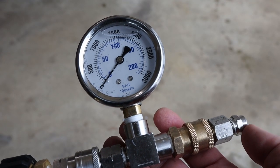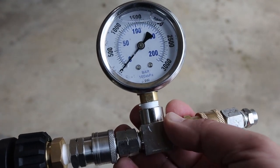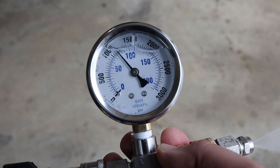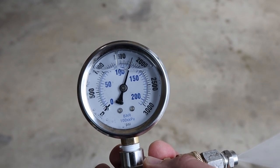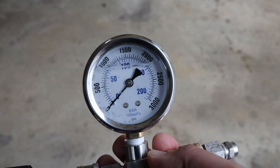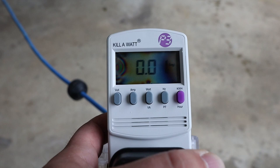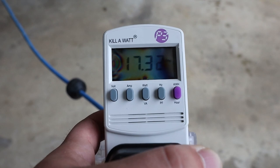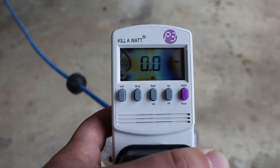I'm just going to call it 750 PSI. Extremely safe — 1.75 gallons per minute. That's pretty good flow. This is the highest tip that I have; this is a 1.0 orifice. I'm hoping it gets 1700 to 1800 PSI — I don't think we'll get towards 2000 with this one. I'm just more worried about my breaker shutting off. I'd say about 1750, creeping up towards 1800 — it's continuing to build pressure as you're holding the trigger down. Here's how much load we're putting on the circuit — it's a bit high: 17.2, 17.3. You saw it was blinking, letting us know it was over 15 amps.